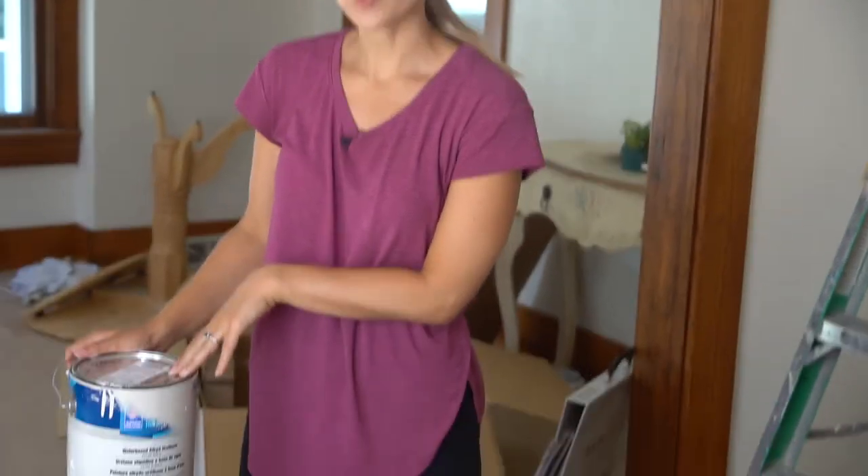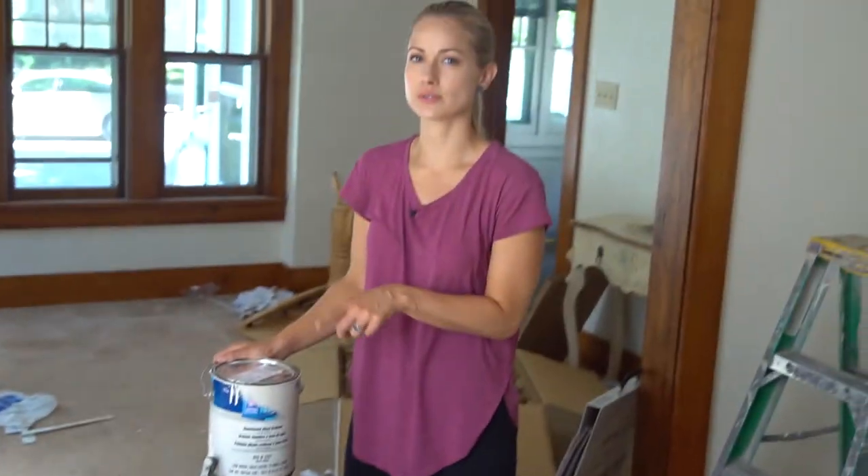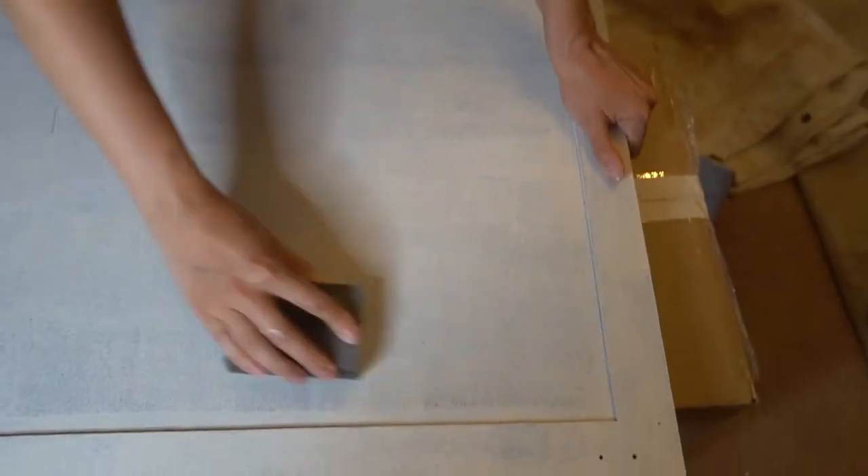Welcome to day two. Now it's time to paint. You're going to want an acrylic latex-based paint with a semi-gloss or satin finish. And here's the fun part — you get to choose your own color. If you're like 99% of the world, it will be white, but I'm feeling a little feisty, so I went with beige. If you want, you can do a little sanding between the coats. You're going to apply the paint just like you applied the primer. Once you're done with coat number one, you snap to day three and apply a second coat.